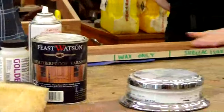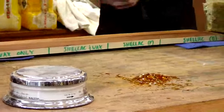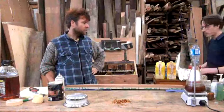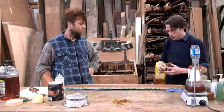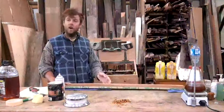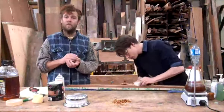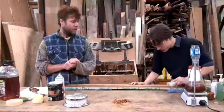The first thing that we have to do with any piece of timber is prep it, though. And that's sanding, which is my least favorite thing in the world to do. But it's important. So what I'll do, say with this board that's pretty good, I'll start at about 240, which is this one, and I'll sand it. For someone who hasn't sandpapered before, the higher the grit of sandpaper, the finer it is, the smoother the finish. Generally you want to progress from a lower grit. What grit would you start on? 240, if it's already okay. I'd probably start on 240.